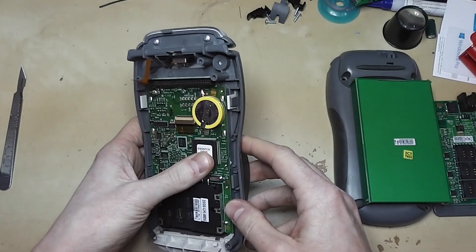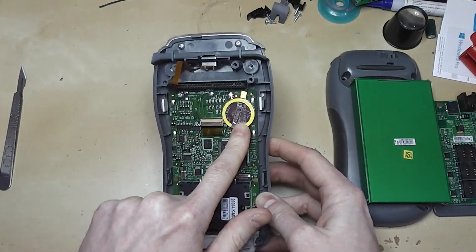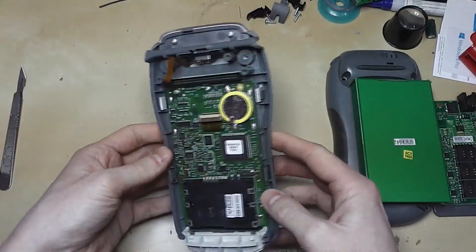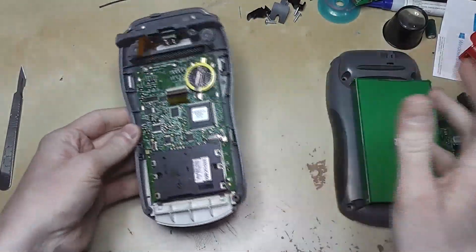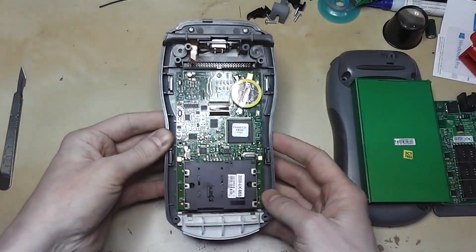This on-board battery is used for the non-volatile memory, and I'd expect there is some kind of security device which is constantly running and looking for tamper events all the time. It might wake up every second, check security, and delete codes if it needs to before it shuts down.